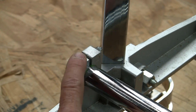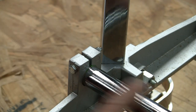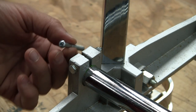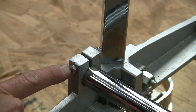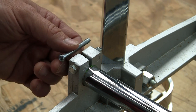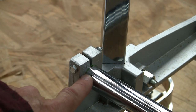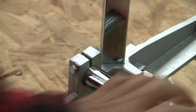This bar is clamped to the mill here and same thing on the other end. There are two problems with that arrangement. First, the opening was way too loose — this bar just slid all the way through. And secondly, the Phillips head screw that came with it — there's no way you're going to get enough torque to squeeze it tight enough. So I replaced the Phillips head screw with a metric hex head bolt, I believe it was M5. You could certainly use a standard nut and bolt there, but this came with a little nylock nut so I just grabbed a metric hex bolt. I also put a shim in there — just a piece of soda can cut with scissors — and now it clamps in there good and tight.